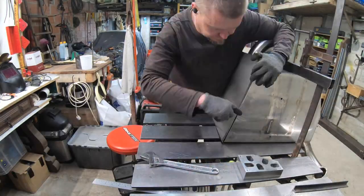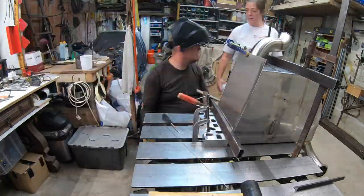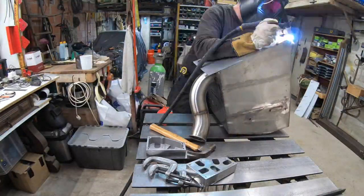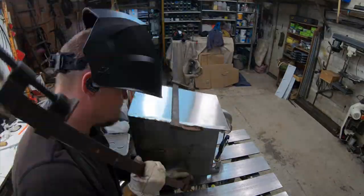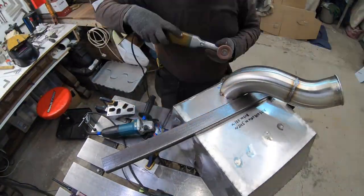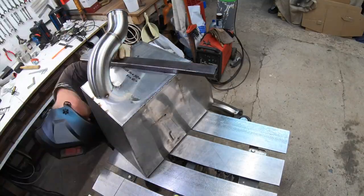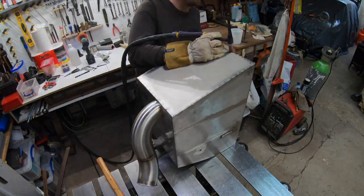I then decided that I'd hide all of this using the top cover. Because everything was wonky as stainless, this took quite some finagling to do. Once it was in, it was back to the routine of clamping, tacking, clamping, etc. Once the sides were tacked in place, I cut off the front lip and tacked that edge too. Then finally the rear of the lid was also tacked.